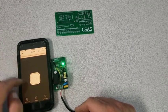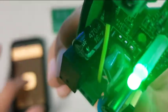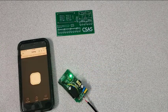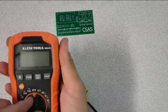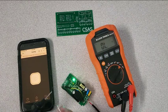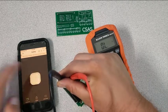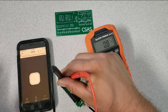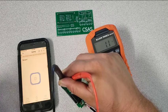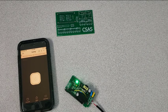I can hear the click when it switches. I'll also verify the dry contact — I put my multimeter on continuity mode. The way this works: if I touch the contacts it beeps, confirming continuity. I turn it on in the app and you can see the relay is operating, and turn it off — it's open.